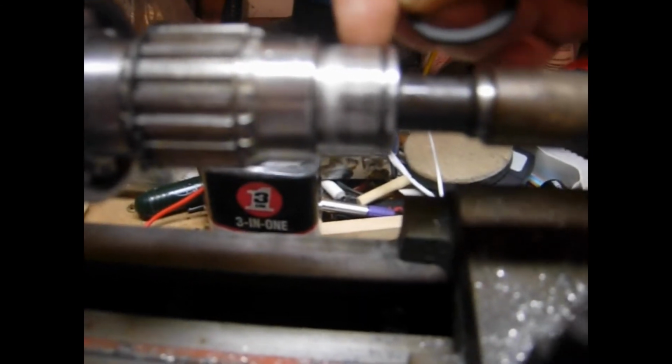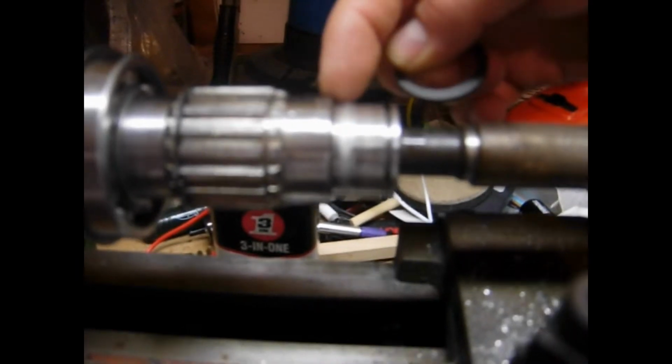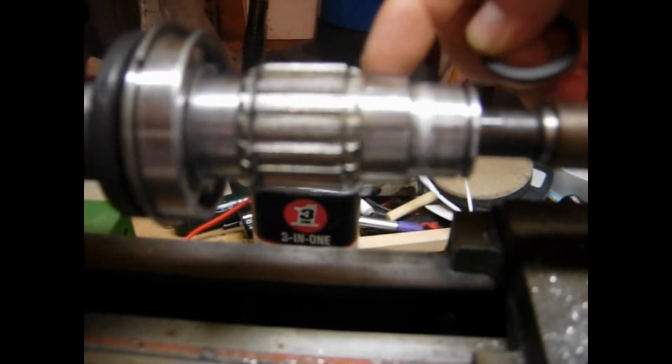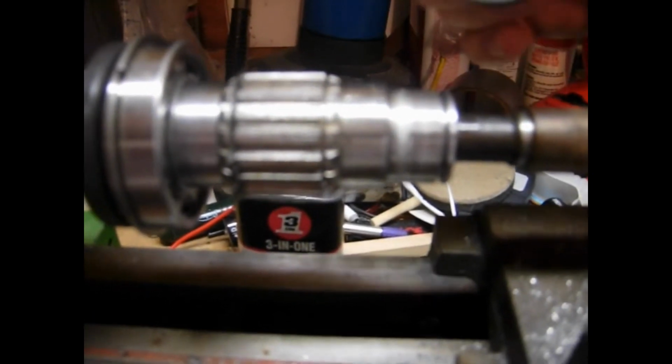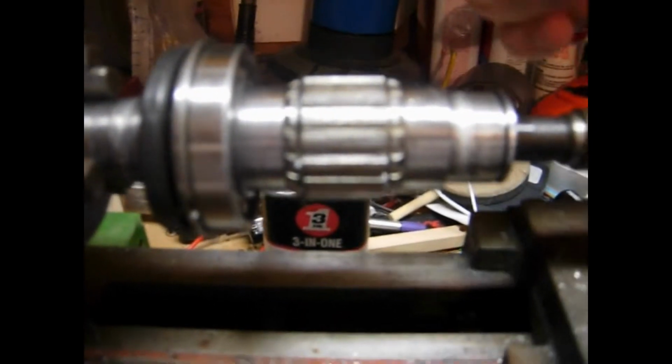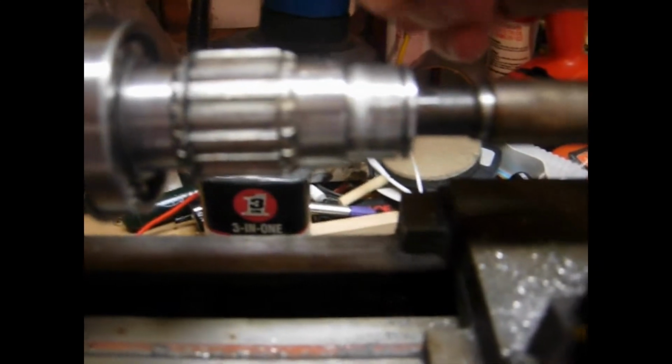So what we're going to do is put this thicker ring, as you can see here, into this groove. But you see the groove isn't thick enough for the ring. We can't cut on this side of the groove because the bearing that goes on here goes up against this shoulder just like this one here does. So it can't go on any further. If we have it go on further, then the seal rings that we have installed in the case to lock the shaft will no longer line up. So that is not an option.